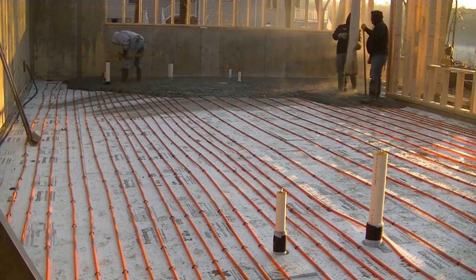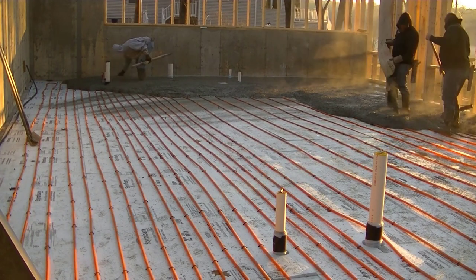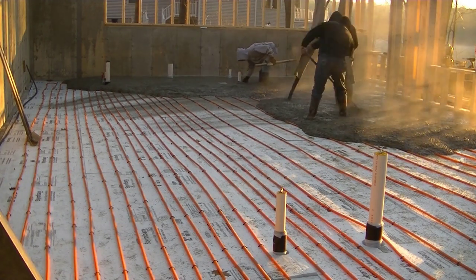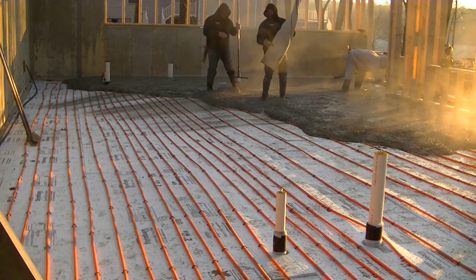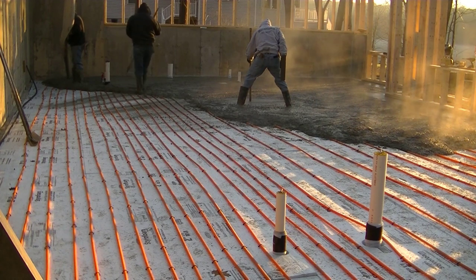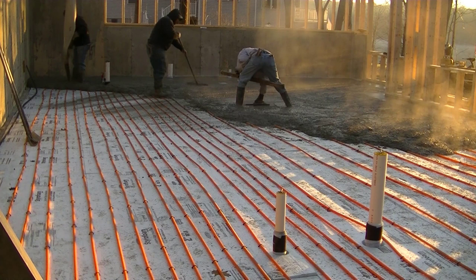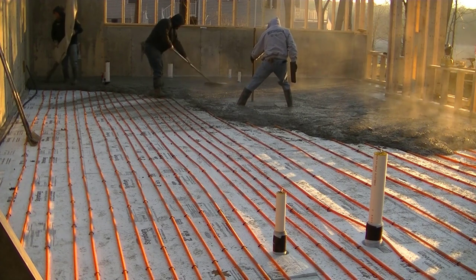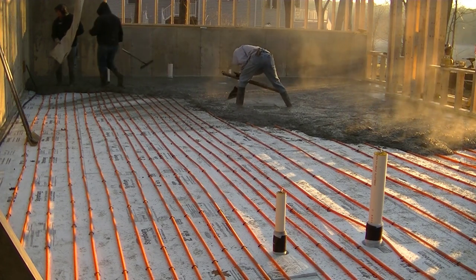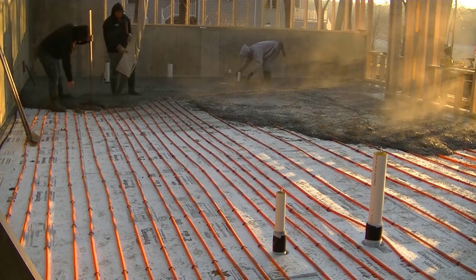A lot of our floors are poured right on Styrofoam because people are using radiant heat tubing. You can see the concrete steaming behind us — the concrete temperature right now is about 80, 85 degrees. The concrete batch plant has warm water; they turn on their boiler and they've got a huge water tank there. When he batches out the trucks, he adds warm water — each truck has about a 300-gallon water tank. That's the first thing with getting the concrete to set up: you've got to have it warm. Without warm water today, we'd be here probably four or five hours longer. So warm water is number one.